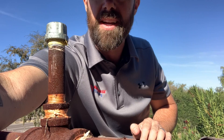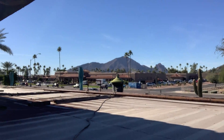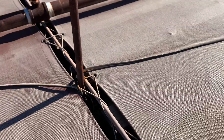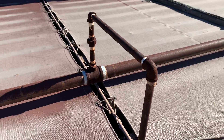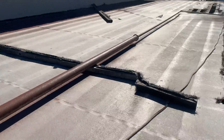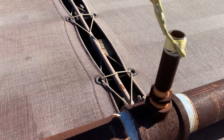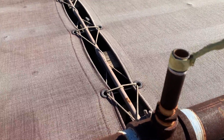We've capped off this gas line. These feed the patio heaters down below, and there are two more to go. The second gas line we're going to cap off. Down there is the third. What I like to do is put some Teflon tape on there and then a little bit of this pipe dope.